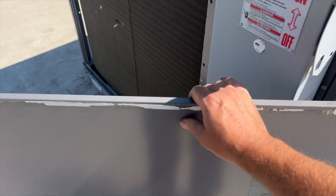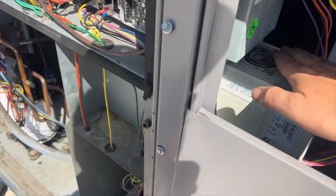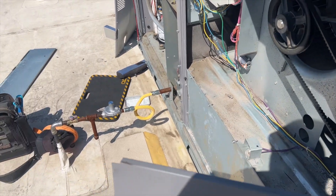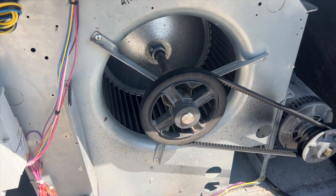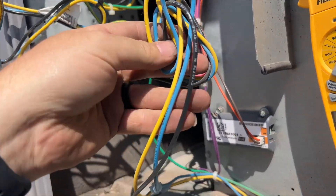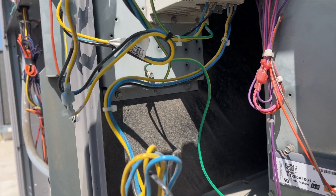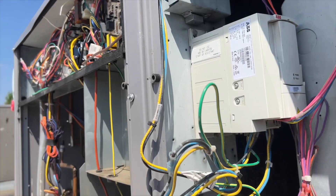Let's see if there's a fault on that. This one actually has a VFD on it. These little fans will sometimes burn out and then the thing goes into a high temperature situation. The belt looks like it's just been replaced. Motor has not been running. Let's see if we have a fault - I don't even see the power light on here. I wasn't seeing any fault lights on this thing, and of course it doesn't have a screen on it.